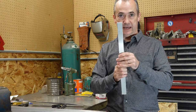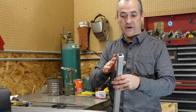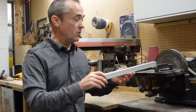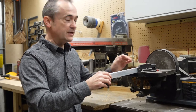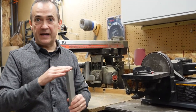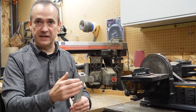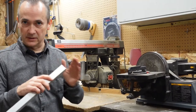At the end you're going to need to do a little bit of filing on the edge whether it be with a hand file or a little bench sander which you can take and do it a few times and that squares it off nicely so you get a nice fit. Without this you could do it with a file or sandpaper just something to take the edges off. If you do a very good job making it square it puts together nicer.